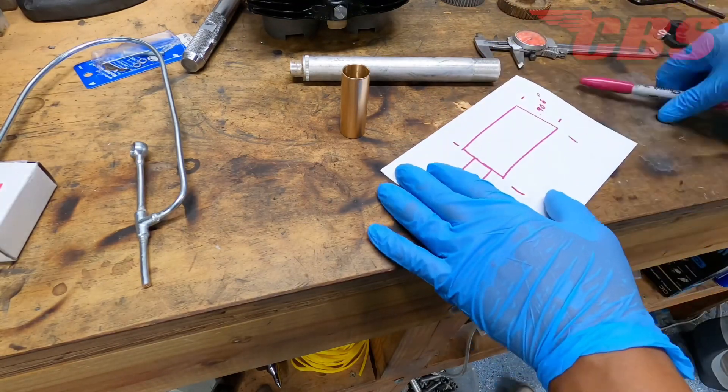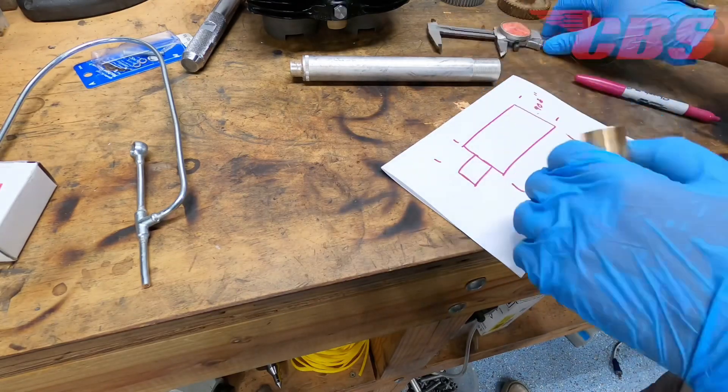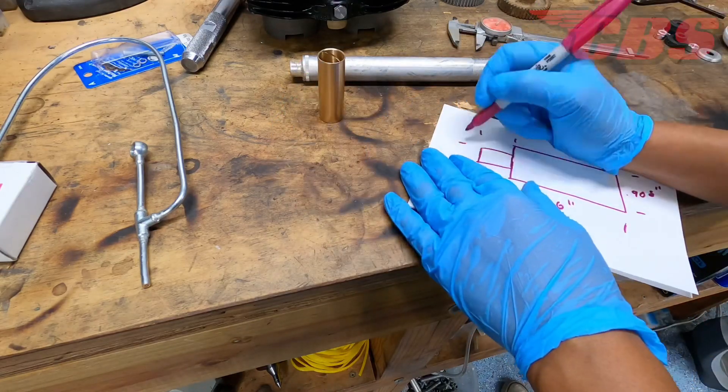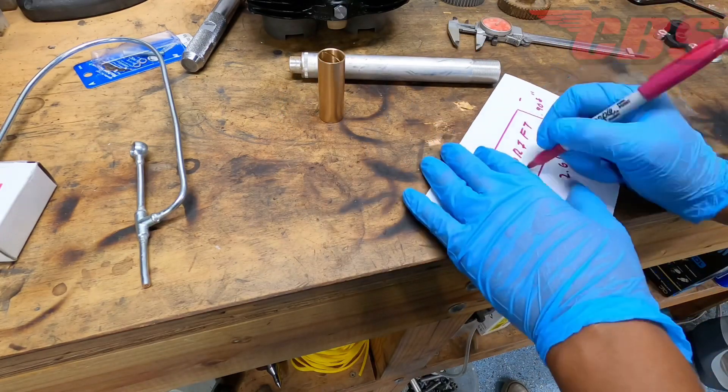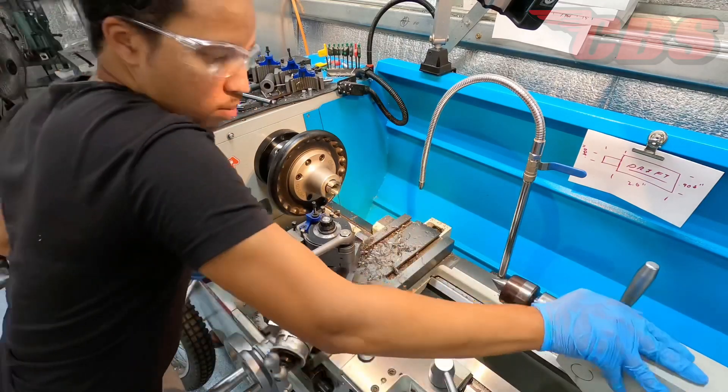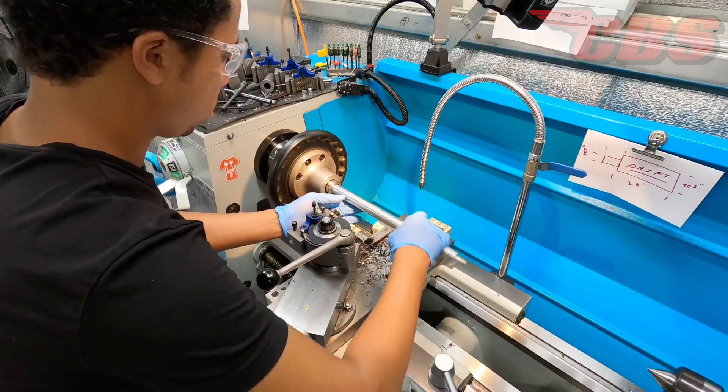For a while I've been putting off making a proper drift dedicated to removing the high gear bushings, basically off of most bikes — Triumph, BSA, unit, twin, singles. So I'm just drawing up some basic designs, nothing crazy, no precision, just measuring the ID of the bushing and then measuring the OD.